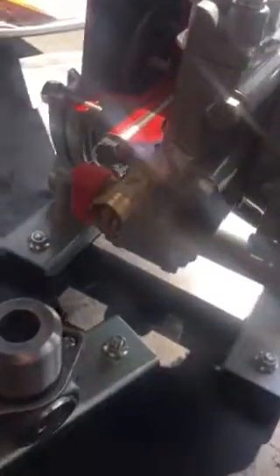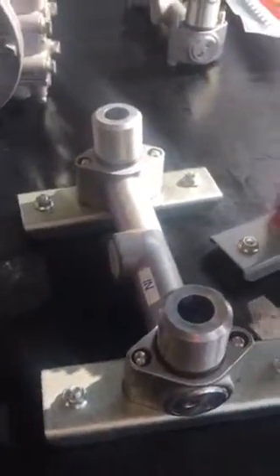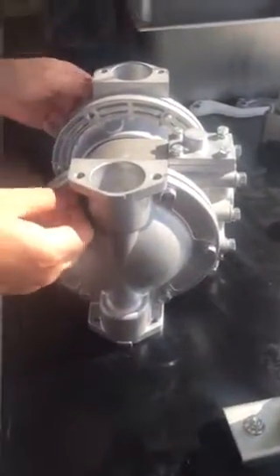This one does put the mechanical override out — fluid going out, back pressure, back in. And if they're pushing that button, it's probably time to redo these. You just take the cap off the pump, slide the valve out, redo the seals, and put the new seals back in. You could buy the rebuild kit if you want, not that people do. But the sleeve is modular.